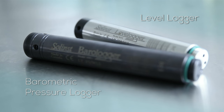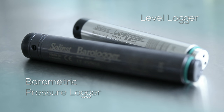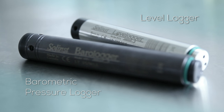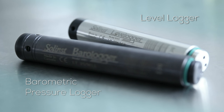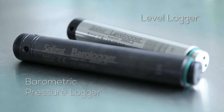The level logger may be a little bit more work to set up in the well initially, but once it's in the well it's going to operate flawlessly for an extended period of time. You only have to remember to go and remove the logger maybe a couple times a year and download the data to see what your well is doing and make sure you're reviewing that information to manage your water conditions on your property.